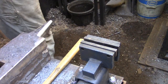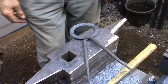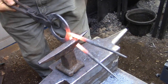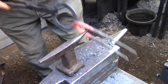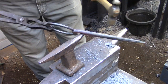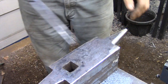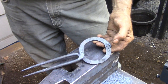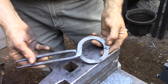This is a very light duty set of dividers that I use to make quick comparative measurements at the anvil, so I don't need a lot of tension because I don't need to hold that setting for any length of time — I'm just comparing one part of the work with another and then they're set aside. So that's the behind-the-scenes video, I hope you like it. Next week I'll do the final version, all cleaned up and ready to go in the toolbox.